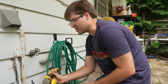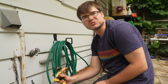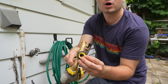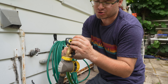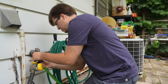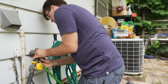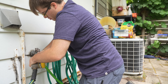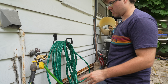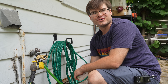Now that we've reapplied our plumber's tape, we're gonna stick this hose splitter back on here and see if it fixed our problem. We'll stick our yellow washer in here — make sure you're pushing it all the way down. Alright, I say we fire it up. It's looking good — moment of truth.